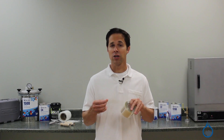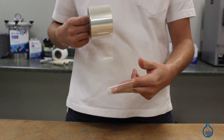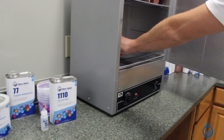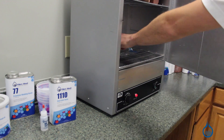Shrink tape is a polyester compaction film used to wrap laminates and create compressive pressure during cure. While shrink tape works in much the same way as vacuum bagging materials, heat rather than vacuum is used to create this pressure. When shrink tape is heated, it will shrink up to 20%, compacting or squeezing your part.